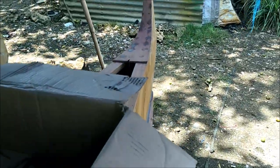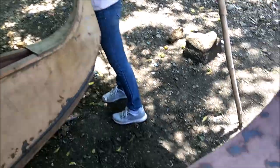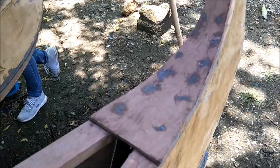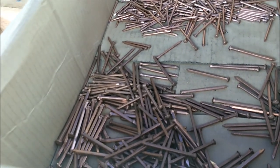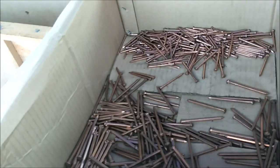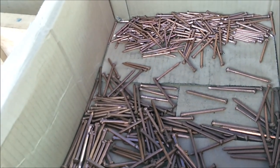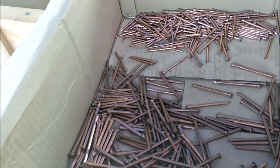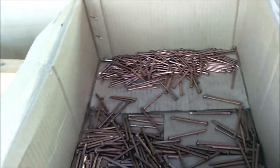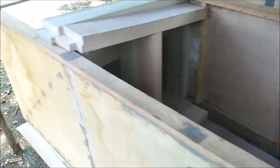Everything is braced underneath here, super braced everywhere, so it should be sturdy. We've got a two by four solid bottom so we're not pushing through the plywood when people are on there. We also got the front plywood on this morning — they soaked the plywood in water overnight and then I cut the wet wood to the shape this morning. And of course bronze nails — people call them copper or brass but they're bronze. Bronze handles saltwater better than any other similar thing because there's no zinc in bronze, and zinc corrodes in saltwater.